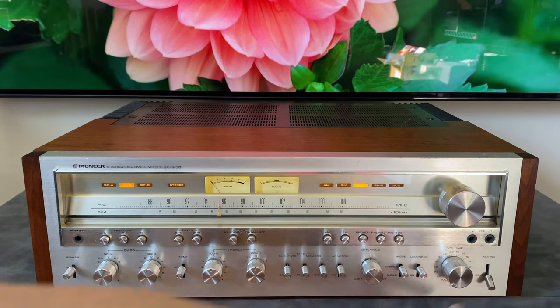I have another one here that's a pretty good example, or maybe easier to see what's going on. All of these capacitors have undergone some sort of thermal stress. So even though they might measure good, I'm going to want to replace all of these. And the same thing goes for the semiconductors on these boards. On this unit, these were all the semiconductors that were on that stabilizer board that tested fine. It was almost all of them, but they have had a rough life.